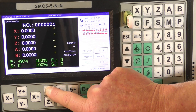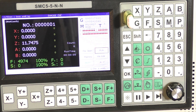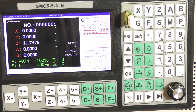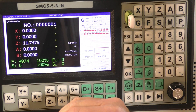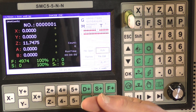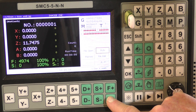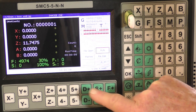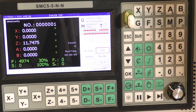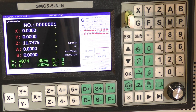We'll just lift the Z up — the tool up off the work. We are now set to run the program. But first I'm going to show you what I do when I start a program like this, because you don't really know how fast the tool is going to go and dig straight into the material. So I like to send it in nice and quiet and see and hear how the tool is cutting before I ramp it up to 100%. I'm going to take the feed rate down to 30%. From there I'm going to start the spindle up — this does not control my spindle yet — and we will cut this pocket.